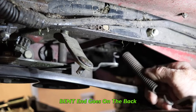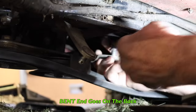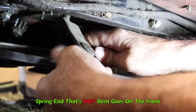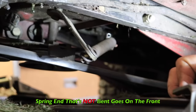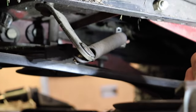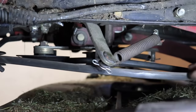You've got to put this end on the other end — I'll show you what I mean. The end you bent, you want in the back, and then the one you didn't bend you want in the front. Then we'll put the clips back in and test it out. The belt was loose with the deck on the lowest level, now it's tight again.